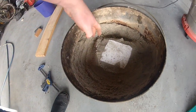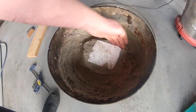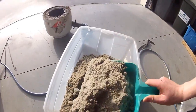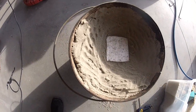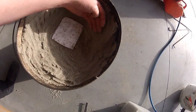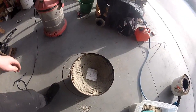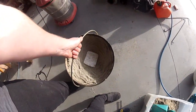I was tempted to go get some more sand, so I went and got some. Now I can actually do this the way it's supposed to. I've got that all packed up around the pouring cup. The sand's a bit moist but it's not so moist that it's going to be dangerous to pour the molten metal into. It's just damp enough to hold it together, so now that's all prepared to be poured.